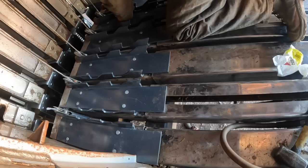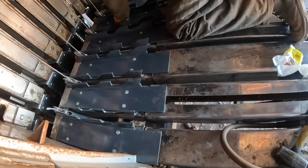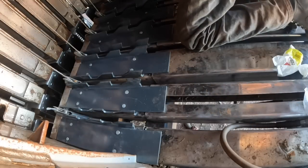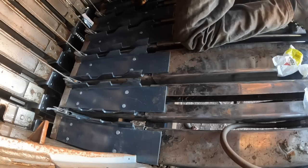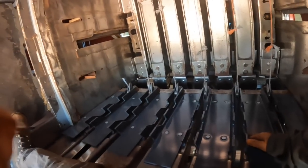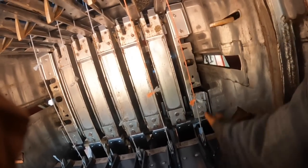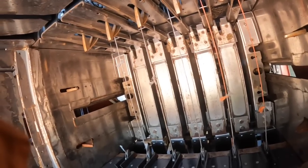May not be, I'm not done right. No, the two that fell on the ground would be just right. All right, guys, let me go climb down there and get them. Zip the nuts on them. I got new nuts. Then I got to put the wear plates back over the end of the plunger there and adjust the side clearance on them. And then I think it'll be ready to bale.